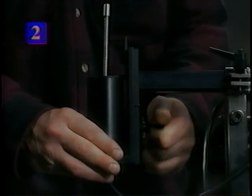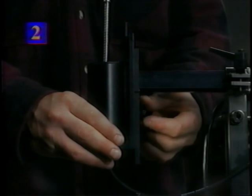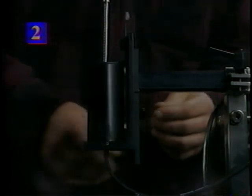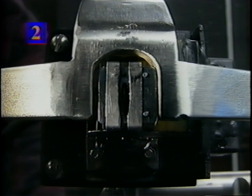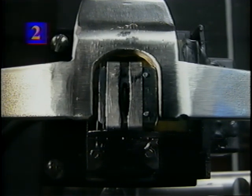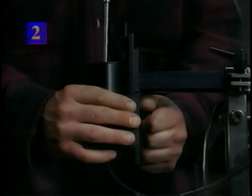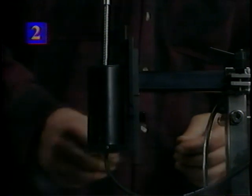Setting the ink level. Loosen the knob in the back of the septum plate to raise and lower the ink container. Observe the array plate. Notice that as the ink cartridge is moved up, ink will begin to flow from the array plate. Wipe away the excess ink and lower the ink 1/16 of an inch. Check to see if the ink continues to run. Repeat this procedure until the ink no longer runs from the array plate.